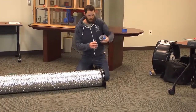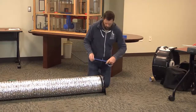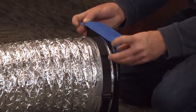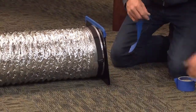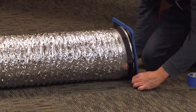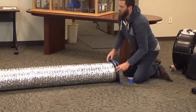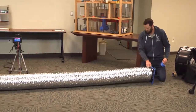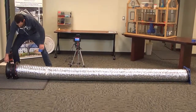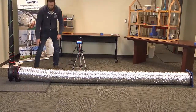In the instructions it says just to tape it on — they don't have any kind of a special ring for it or anything. Let me just make sure I'm kind of lining it up. And then you want to make sure you've got this stretched out kind of tight so there's no kinks or bends. This test will help determine if there's any holes in this duct or not.